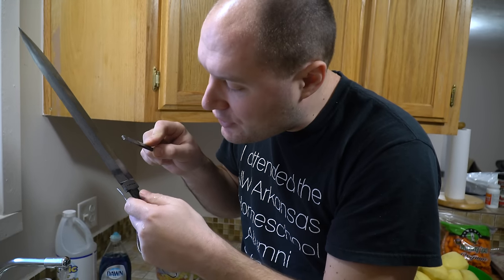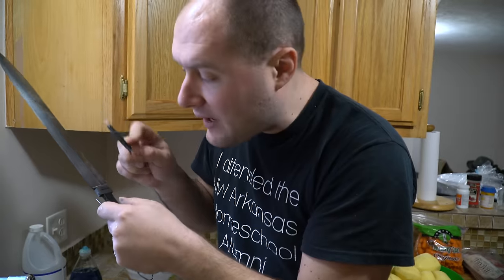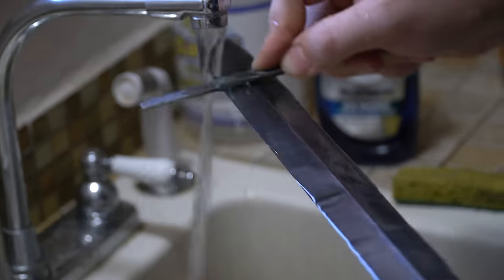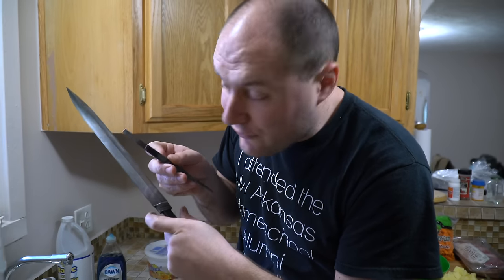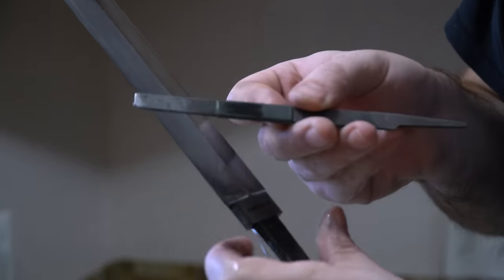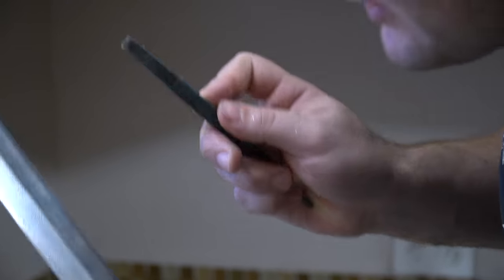As time progresses, when I sand the oxides off you can see more and more the pattern is really starting to show through. You basically want to keep doing this until you have the desired depth — I can't give you an exact number because it depends on the pattern. Also, keep your sandpaper fresh; you can see it's getting oxides on it and not sanding effectively anymore, so just peel off a piece and use a fresh area.